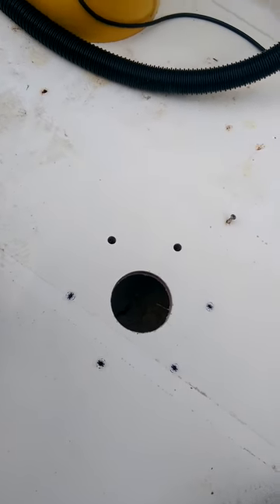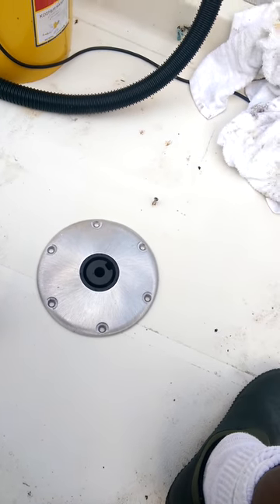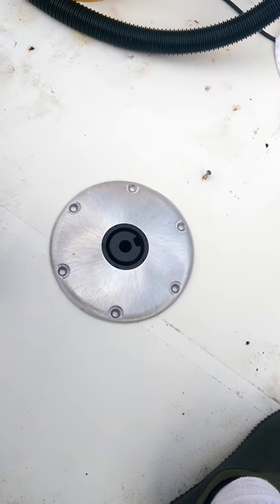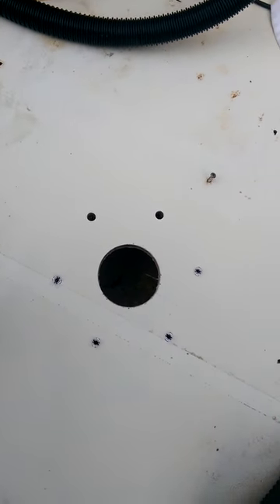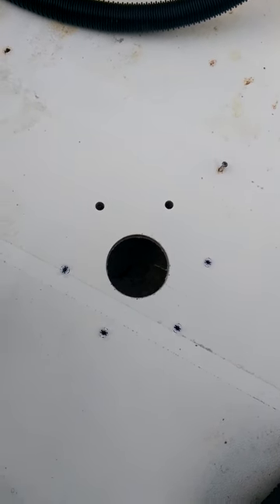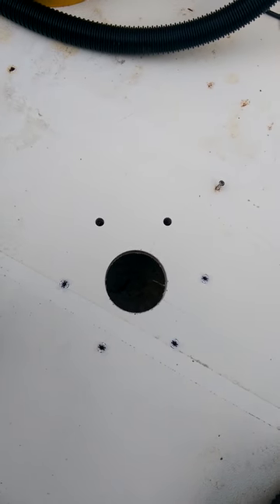All right, everybody. We're putting down a plate — we're adding seats to the boat. As you see, we have a flush mount, a sub mount seat for the pedestal, and a bracket for the pedestal. What we've done is cut the hole and drilled six holes surrounding it. Right now we're putting in the anchors to be able to put the stainless steel screws and the rest of the hardware in to hold the pedestal base to the deck of the boat.